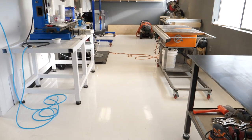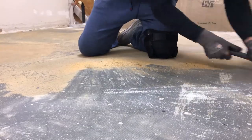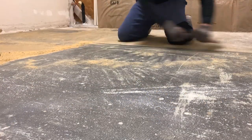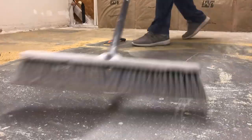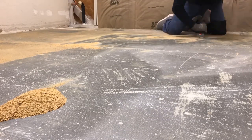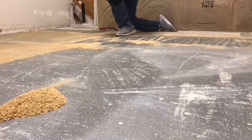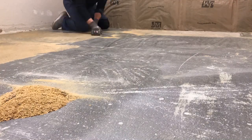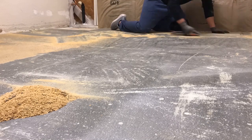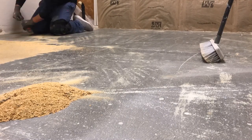But with any floor coating system or paint system, prep work is about 80% of the battle. You've got to prep that floor. I had carpet adhesive under the carpet that had to come up — this time-lapse is about a 45-minute job, just scraping it up on my hands and knees, a little elbow grease. Then I abraded it with some 60-grit sandpaper. The Coratec does call for a primer for concrete, but for a wooden subfloor like this, you can go right on top of it.